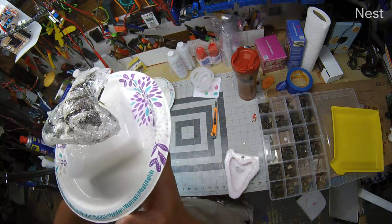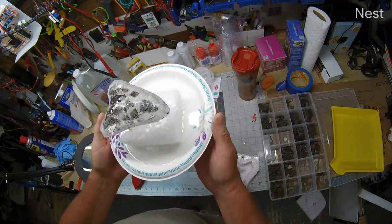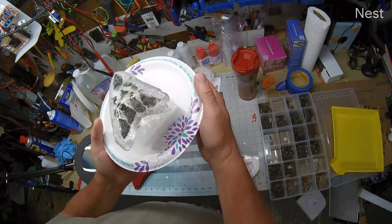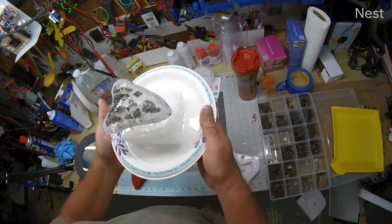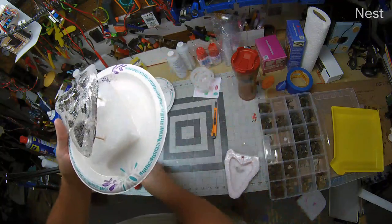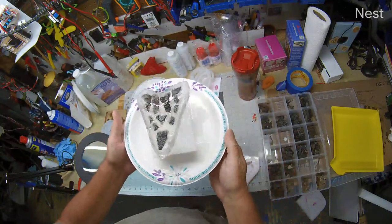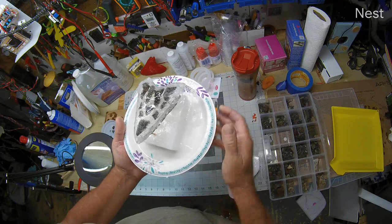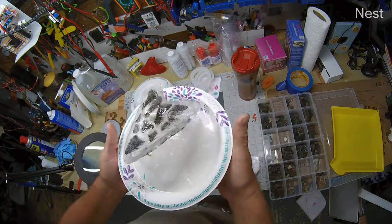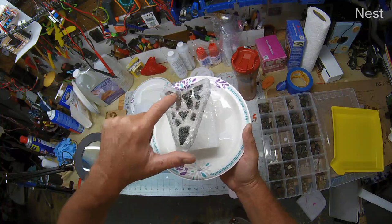I'm going to change the way this is done — this was an experiment in casting. These are all megalodon teeth parts cast into a megalodon shape. That turned out pretty cool. It's not as transparent as I would like, but from a unique paperweight standpoint, that's kind of cool. Because of the ridges from the print — it was printed coarsely and I didn't fill or sand it — it wound up with a bunch of lines so you couldn't see through. What I did was pour another coat on top after cleaning it off, and it turned into pretty clear — surprisingly clear actually. Might need another coat on top.